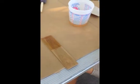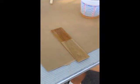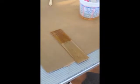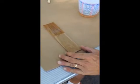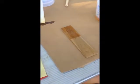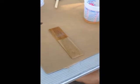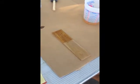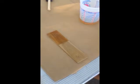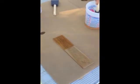Now you're only going in one direction here. Correct. You have to be careful, obviously, not to overbrush, or you might risk getting some bubbles. Correct. One thing that you gotta remember is when you're applying to bare wood, your first probably two coats, you're gonna get bubbles, and that's just the product filling in the grain and the air escaping. It's air escaping from the cracks and crevices of the grain then. Correct.